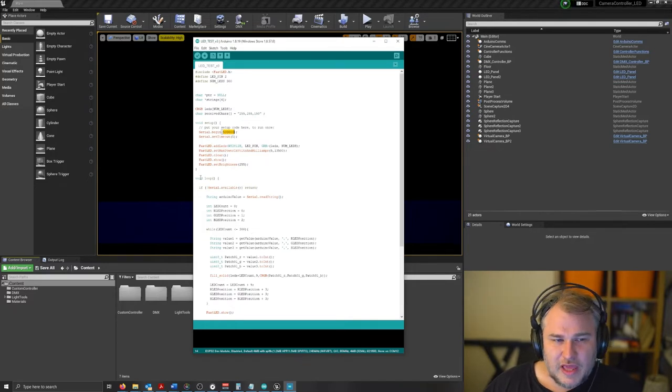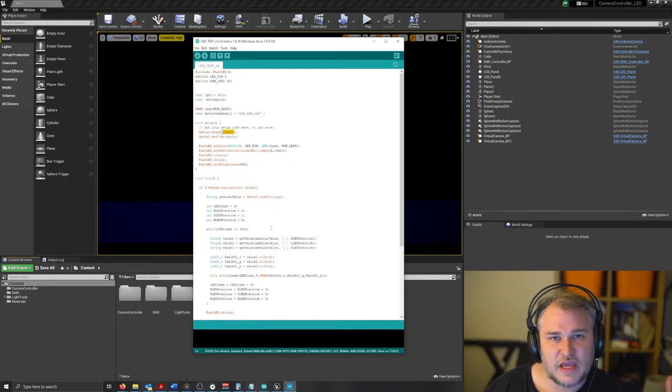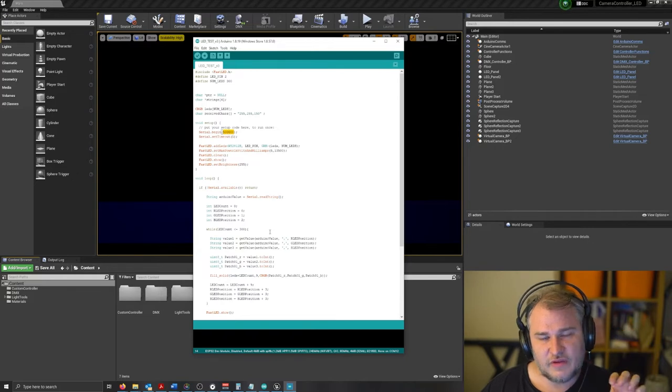In theory, if we've only outputted a string of 9 RGB values, or maybe one RGB value, it'll update 9 LEDs. If it's 2 RGB values, it'll be 18 LEDs, etc., etc. And then after that, it'll turn it on. So in essence, what this will do is it'll read the CSV, grab the RGB position, split it, update the lights, and then jump to the next section and do it again. So every single loop of this loads in the command to say this set of 9 LEDs will have this value. This next set of 9 LEDs will have this value.